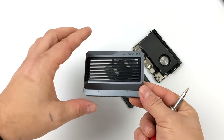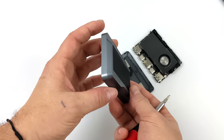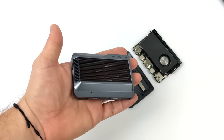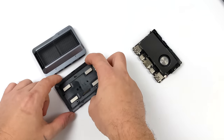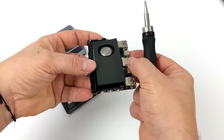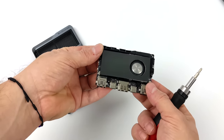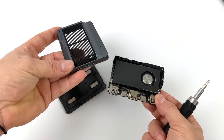I think they've done a great job with the design. Having tested a lot of different cases — plastic, aluminum — for single board computers, personally I think this is the best looking case for a single board computer I've seen so far. If you pick up the PC kit, it comes with the active cooling kit, which has a really nice aluminum heat sink and a blower style fan. The fan is PWM, so whether you're running Android or Linux, it's fully adjustable from software.